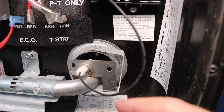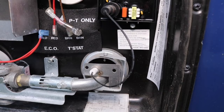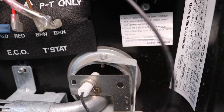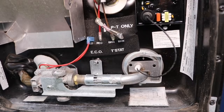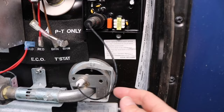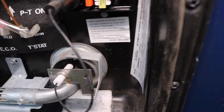The next item to check would be your igniter. Our igniter is actually right in there — basically this rod goes down and it'll ignite the propane. Check to make sure that it's sparking, because if it's not sparking then your propane water heater is not going to light. So let's turn that on real quick and show you what it does. You can hear that click and you can kind of see the spark in there. It just sparked but didn't light — our propane is off so that's why it's not working. What you can do is pull this piece off and take some sandpaper and sand both rods to make sure they're clean and free of debris.